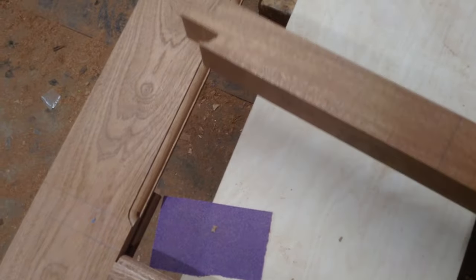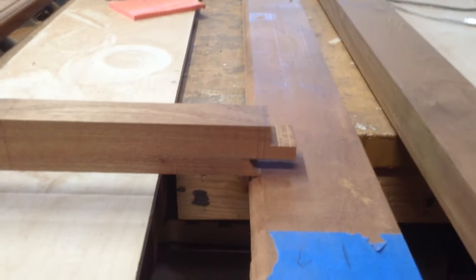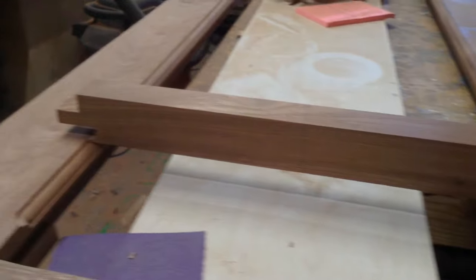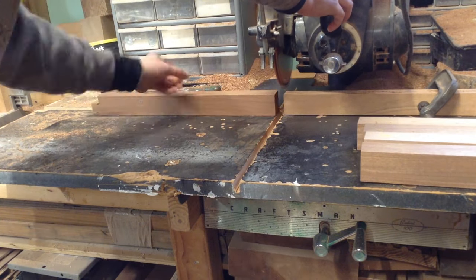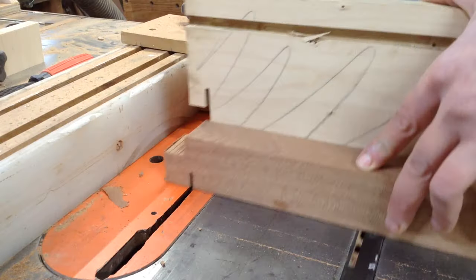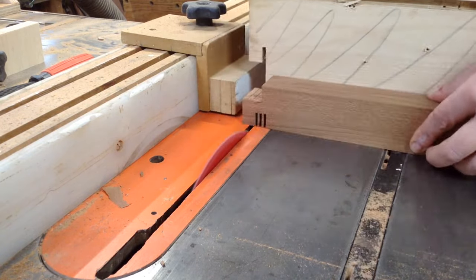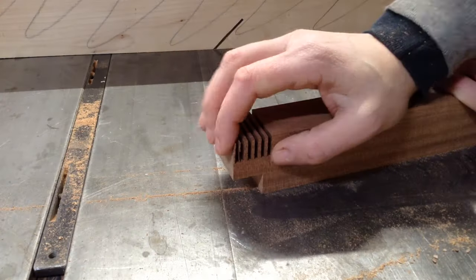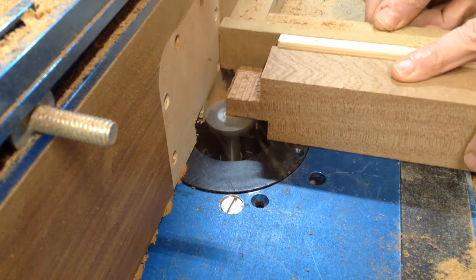You can see when I now lay this in place, my two cope edges fit on top of that molding perfectly. If I flip it over, it fits inside the other door's rabbets perfectly as well. Because I hadn't figured out the alignment of the mortises first, that's what made this a little more difficult — I could have just figured out my spacing first and gotten the measurement that way. But I wanted to make my profiles before doing the mortises. Now I can cut both sides at the same time: cut the rabbet on the radial arm saw, remove the bulk of material for the cope on the table saw, and clean up that joint on the router. It's a very quick process once you have it all set up, but setting it up took a little bit of time.